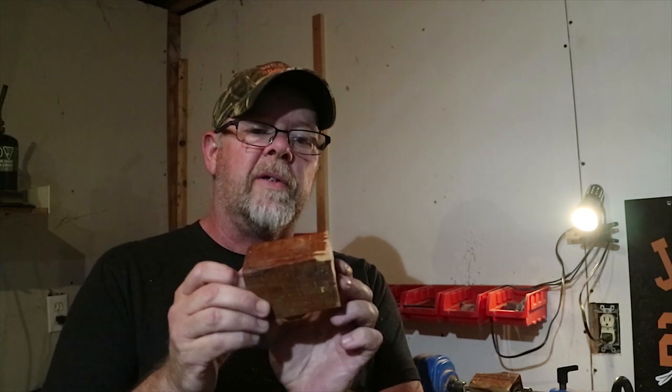on my lathe. Now I already got a piece already set up here on the lathe. I've drilled my 5/8 hole. I've got it sitting on the mandrel. Everything's ready to go. The first thing we have to do is obviously make it round. So we're gonna true up this piece, then we're gonna square up the ends, then we're gonna add the shape, but I'm gonna speed it up so this isn't an hour long video. Here we go.